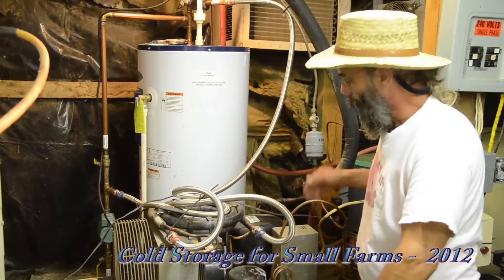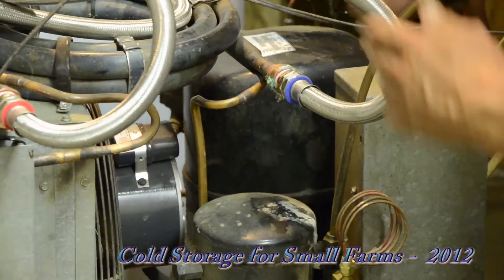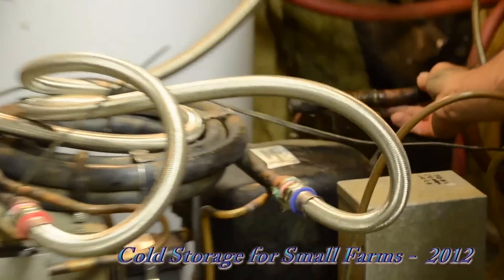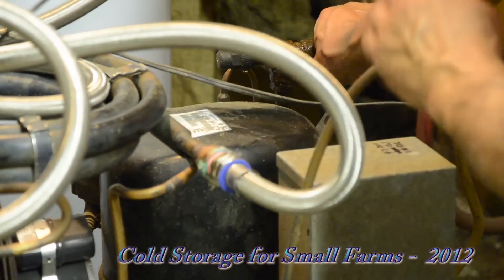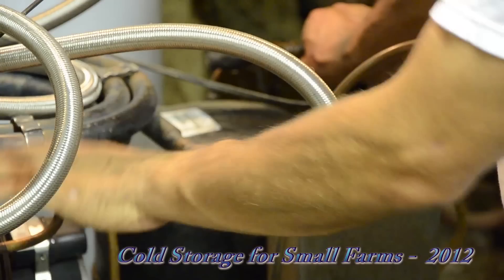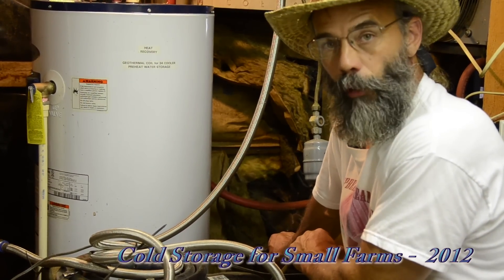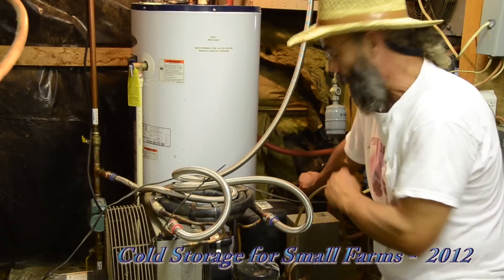The hot gas side comes out through our cooling system, condensed by both air and water, producing liquid refrigerant. That liquid refrigerant is boiled in our evaporator and comes back cold — you can see the condensation on the unit. The return tube is getting colder. If it's getting hot on your unit, that means there's inadequate cooling happening at the condenser, and some of the refrigeration capacity is being used to remove heat from that hot fluid going into the walk-in. That's one of your key signs when your unit is undersized or can't reject enough heat.